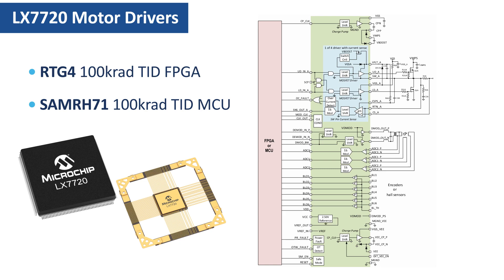Motor types include permanent magnet synchronous motors (PMSM) and brushless DC motors (BLDC). Both are permanent magnet based motors with the permanent magnets on the rotor. The stator contains equally spaced Y or delta connected windings — three for a three-phase machine. PMSM and BLDC motor design varies in detail and also in drive waveform: sinusoidal versus trapezoidal or triangular.